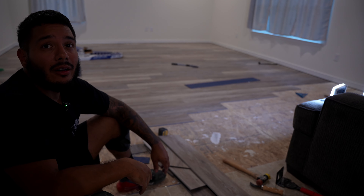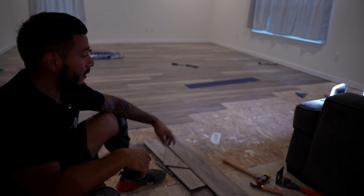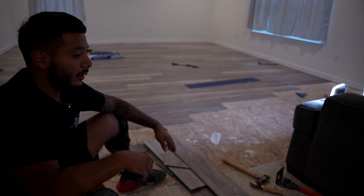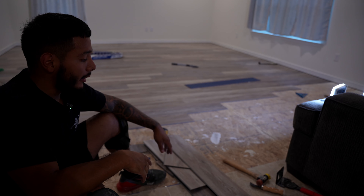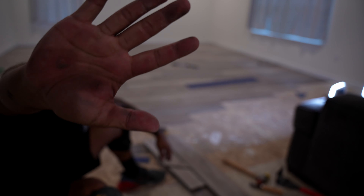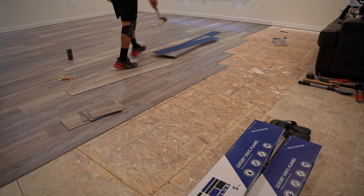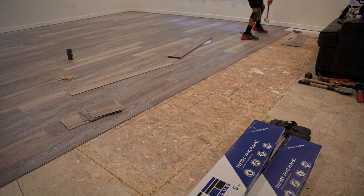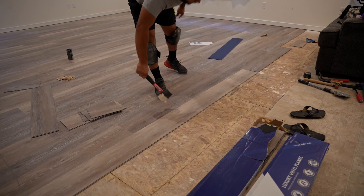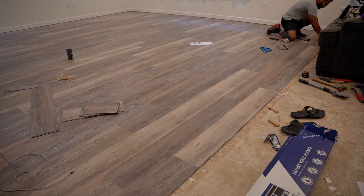So this is what I got done for today — about three hours worth of work. It's about eleven boxes, sixteen boxes total. I'm going to leave it off right here; I still have to do the kitchen later because I got to pull up the vinyl. This is what I've done so far — look, blisters! As you can see, I'm laying down these last planks. This box comes with around four different shades of brown, which is why I said to use the staggered pattern — you don't want to lay all one row light colored or all one row really dark.